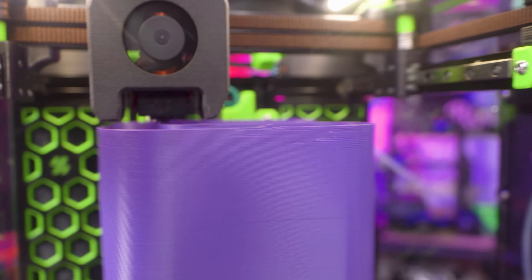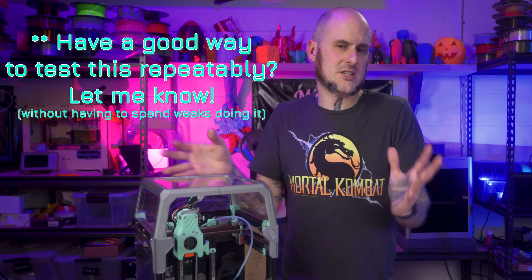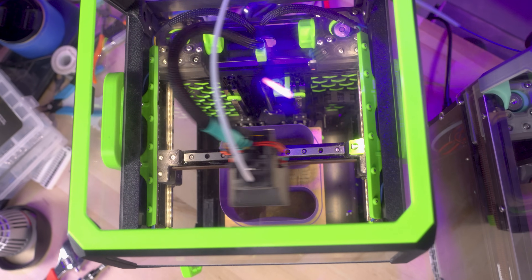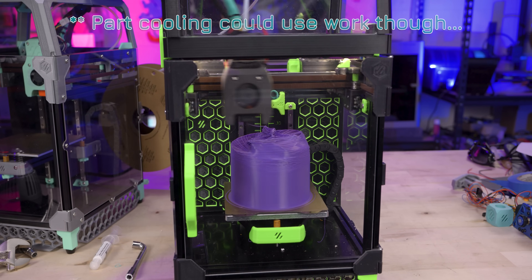I know some of you are yelling at the screen — or have already left comments, thanks for the engagement — saying this is an inaccurate flow rate test because the printer is likely under-extruding before the actual failure point, and it almost certainly is. The wall thickness is probably thinning out before it fully fails; we're not reaching the target 0.45mm wall right before the failure point, and the actual failure could be occurring many millimeters below where I'm measuring. Testing for that specifically would be a very in-depth process, but I still feel I've presented data that can directly compare these nozzles against each other in two different hotend applications. I can see my Dragon hotend is flowing more than I realized and I've been under-utilizing it.